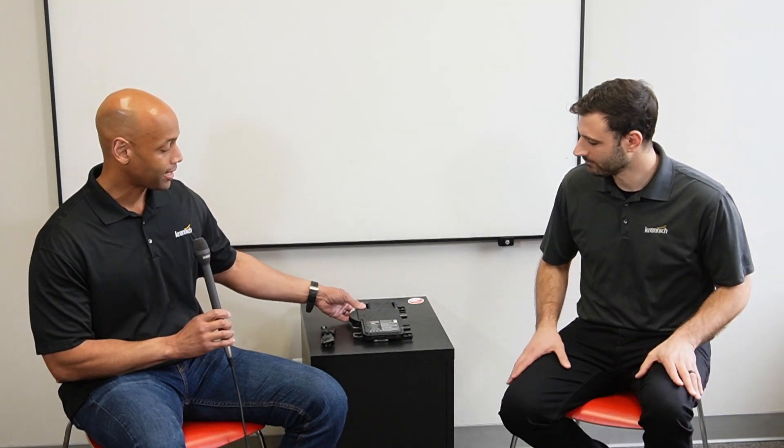For those of you that are currently installing Enphase IQ microinverters, a couple of things you're going to want to know about the Enphase IQ8. The biggest thing is this new feature they call Sunlight Backup. Instead of having a separate backup battery for energy storage, with the Enphase IQ8 you can actually run a portion of the home directly off solar panels without any battery storage. It includes a transfer switch, like a home backup generator, which isolates your house from the grid and allows the microinverters to energize directly into your home on a handful of circuits.